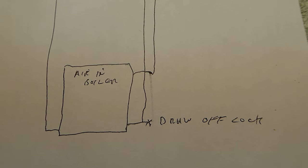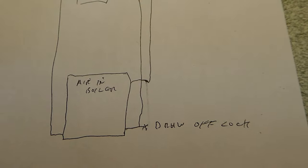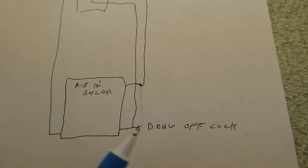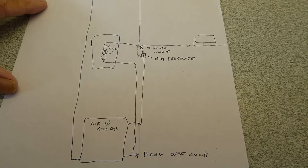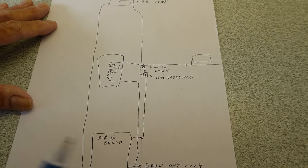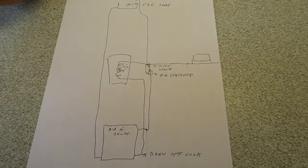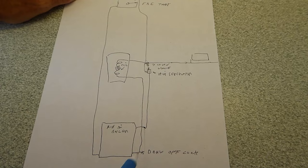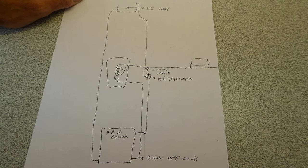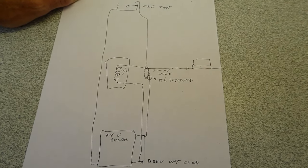Most boilers you will find a drain valve somewhere close to the boiler. Even if it's hung on the wall, there's usually a drain-off very close by. Leave all your water on, don't turn anything off, just attach a hose on there and run it outside for about a minute. Leave the tank so it's filling while it runs, and it will draw that air out and get rid of the airlock in the boiler. Sometimes you can have air cocks all over the place, but they still don't clear air stuck in a boiler. My recommended method: hose pipe on the drain valve, don't turn the water off, let it run. Only about a minute — maybe even 30 seconds — and you should hear that air go out down the hose pipe and away, and everything will be back as it should be.